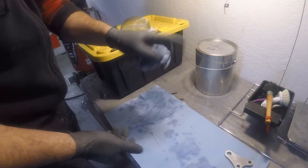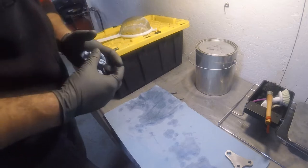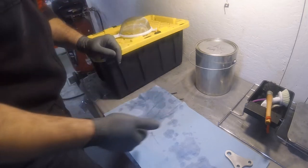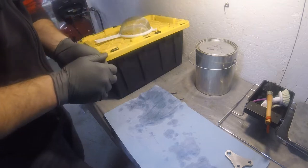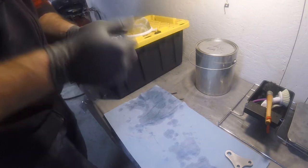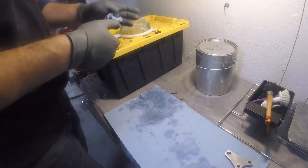We'll open up the can, get these parts in there, and then we're going to let them soak for 30 minutes. It's the best thing to let them soak. Wiping down is just not efficient. There are some exceptions with some bigger parts. I talked to Cerakote on the phone, and they have really good tech support. You can hit stuff with Bright Clean that doesn't leave a residue. You hit it really good with Bright Clean. Right now, I just don't have a big enough acetone tank.